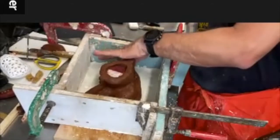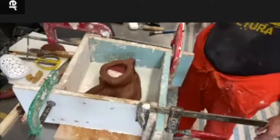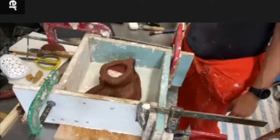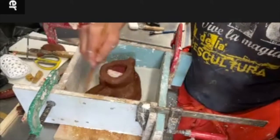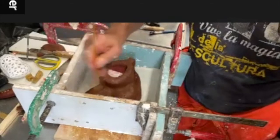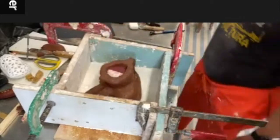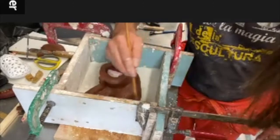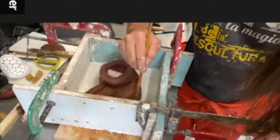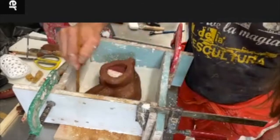Okay, so Terry, next step. What do you think? What's the next step? You should know. Fill the wall first. No. With Vaseline. Don't forget the Vaseline. Otherwise, you're going to end up in trouble. So you cover this in Vaseline, because if you pour more plaster onto this and you don't insulate it, the plaster will stick to the plaster that isn't insulated, and you will not be able to separate it. So we use, in this case, Vaseline.